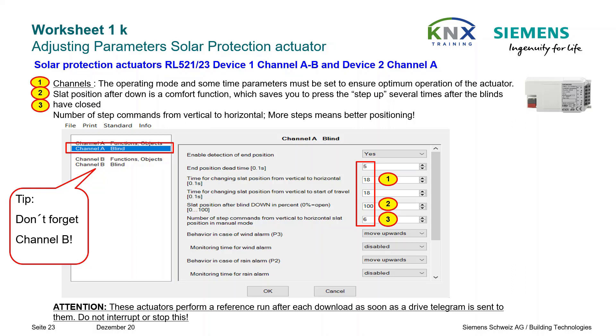By the way, the travel time would be 20 seconds with manual setting in the Gamma Training Kit. The slat adjustment times are, again due to simulation, both identical, because the LED simulation only makes 90-degree slat movement. In the Gamma Training Kit, comparatively long adjustment times of 1800 milliseconds are set here in order to achieve better precision with regard to the six steps via the seven-position LED.